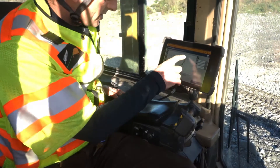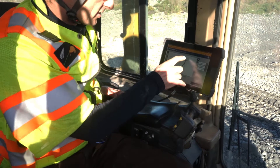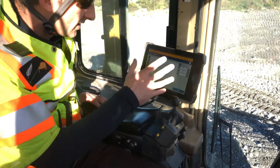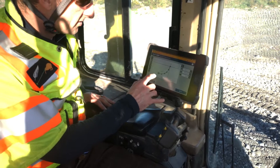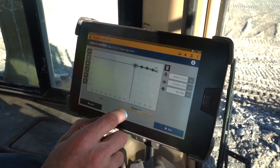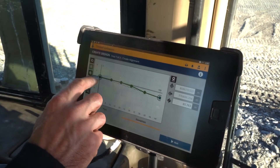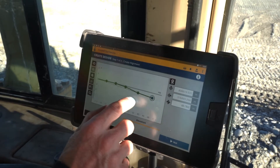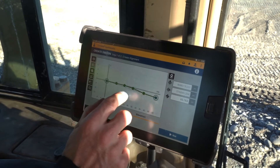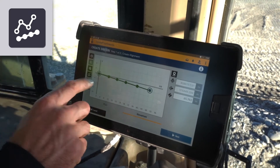We've picked up all our blue stones now, so we've got our alignment from the top of the ramp down to the bottom where we are now, with a nice smooth curve at those 10-metre spacings. We can smooth it up a little more by eye while we're building it. What we want to do now is make sure we've got that constant mainfall grade, so I go into the elevation tab here. You can see it was quite flat up the top and then steepens as we come down, so I want to go from start to end - make sure my blue circles are on the start point and end point - and then use this button here to smooth that grade out.